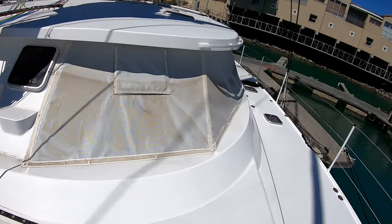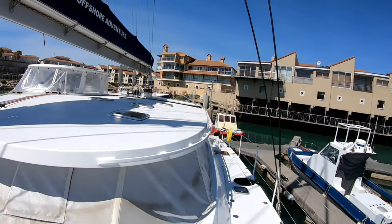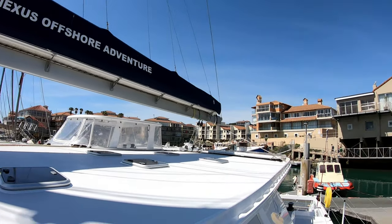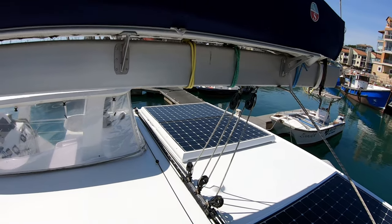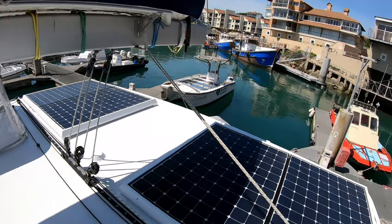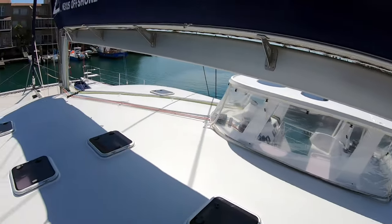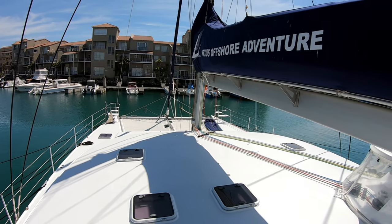It's really sad she's sitting here - we're really chomping at the bit to get out again. She's a super comfortable vessel that runs incredibly well, incredibly fast, and eats up the distance. On top of the coach roof we've got four times 320-watt solar panels giving us 1,300 watts - running about just under 60 amps per hour under perfect conditions. Plenty of juice; we basically never had any problems. When we did the trip up to Mozambique we only started the genset twice in the entire trip.